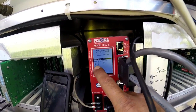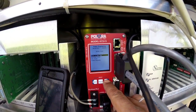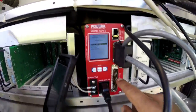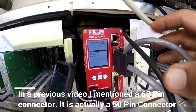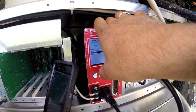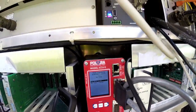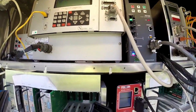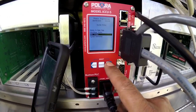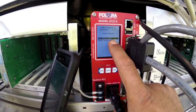You can see what phases it's calling and so forth. Another option: if you're not using the 50-pin connector and you're going through the SDLC, you can check the status on the unit and it basically tells you that it's connected to the bus interface unit that runs throughout the cabinet. You also have system information, which tells you the software version and so forth.